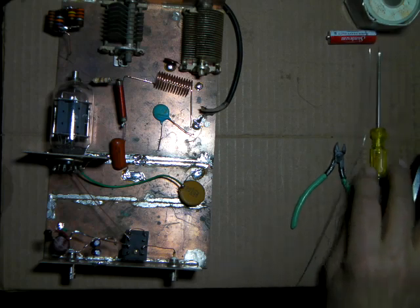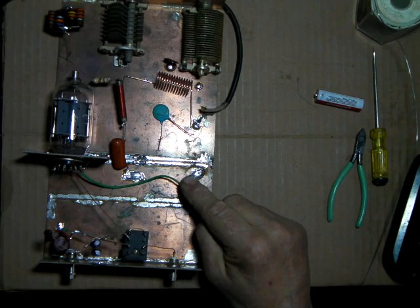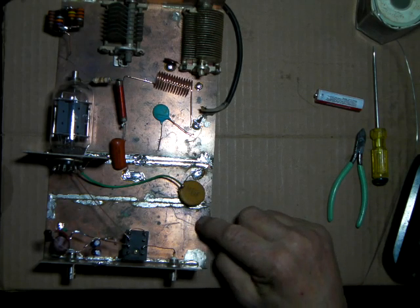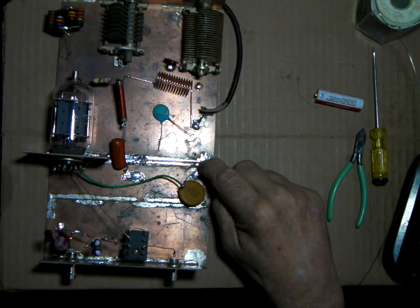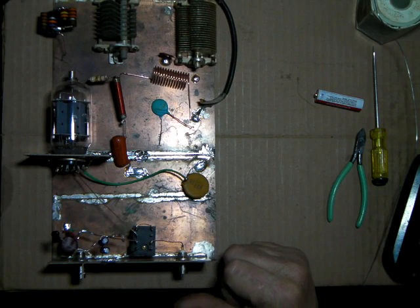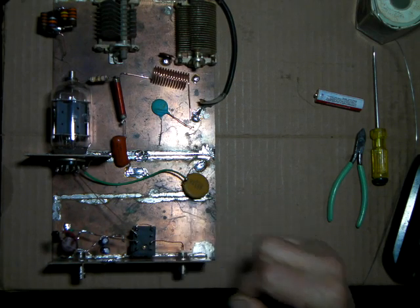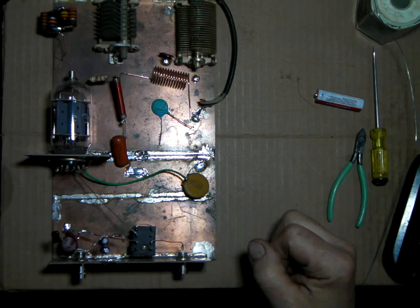I got to find my power supply, get it out, and so on the next video we'll hook up a filament lead here at 6 volts, a ground, and 700 volts, and we'll fire this thing up. Oh, and 25 volts will have to go to the other side of the relay to activate when we have RF current to there.